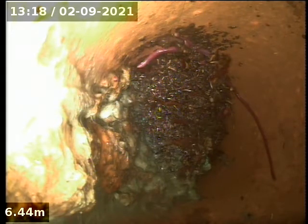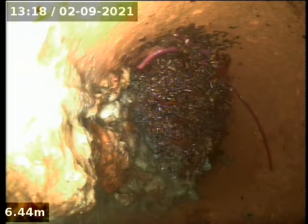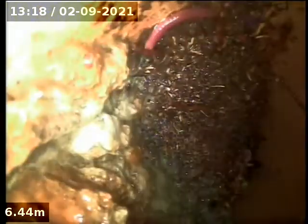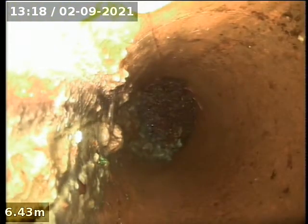Another head. Let's try and punch through it. We're at 194. Blockage of 194 Ferrars Street. We've gone up from 196 Boundary Trap, the lowest lead-off in the cast iron trap from just before the bottom of the BT. Gone up some 6 metres, turns left and heads across to 194. We're at the blockage. We'll try and clear that now.